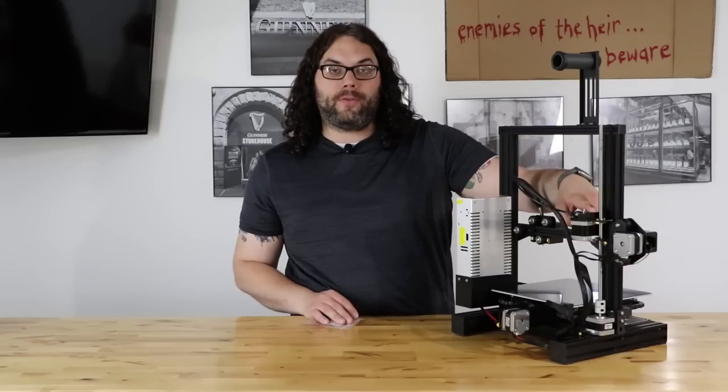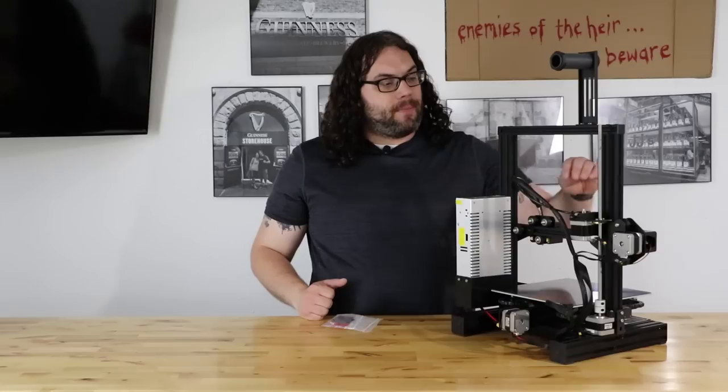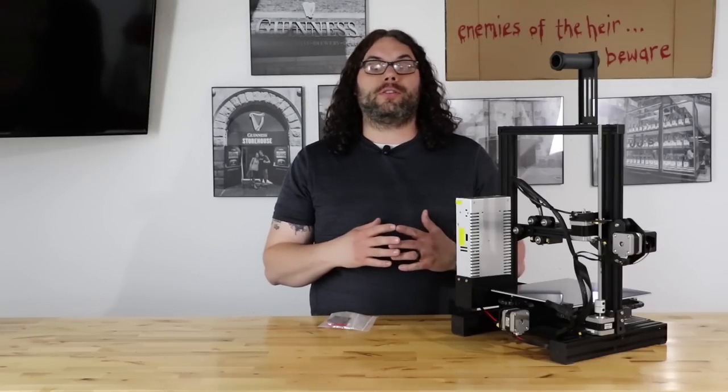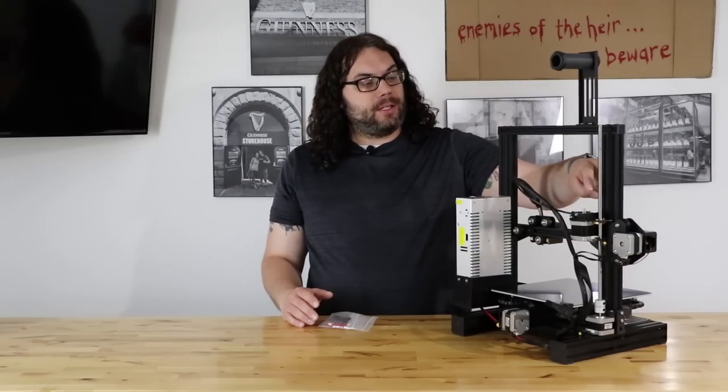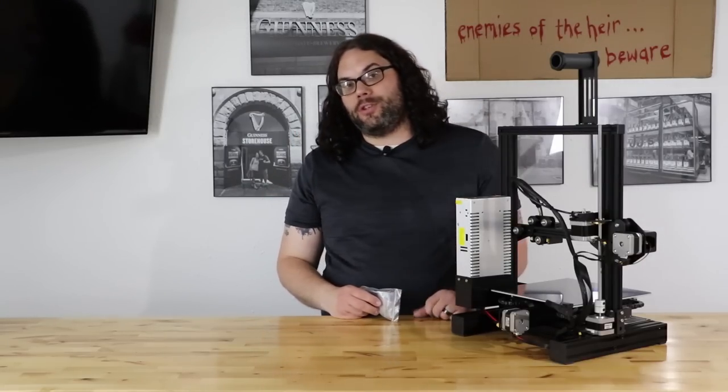Some of the other reasons why we want to do this is because this factory extruder from Creality will crack eventually. If yours is working and it's not cracked, awesome, keep using it. But sometimes under the arm you'll get a crack. Some of the things you can look for are under extrusion, maybe clicking in the extruder, and bad prints. If your prints just go bad one day, check the plastic arm on the Creality extruder. If you don't see a crack from the top, look underneath it because a lot of times it cracks underneath where you can't see it.